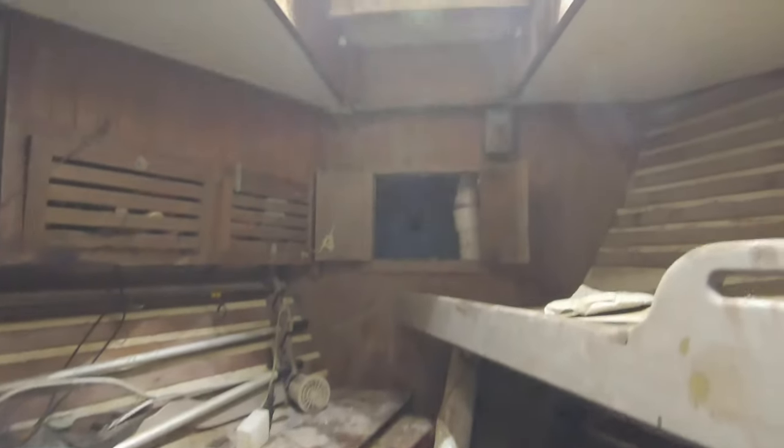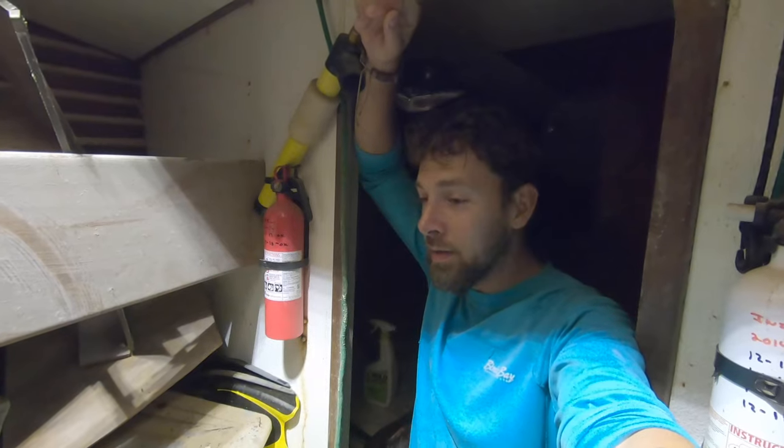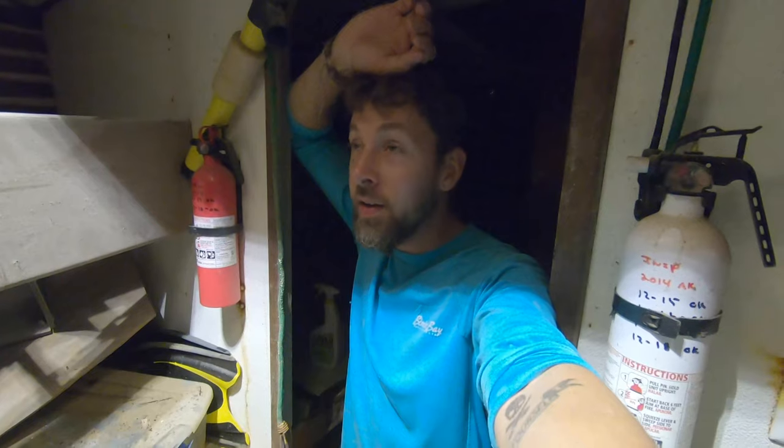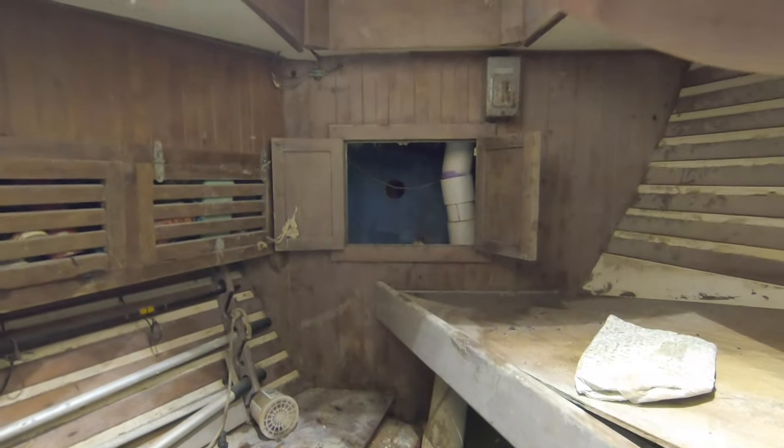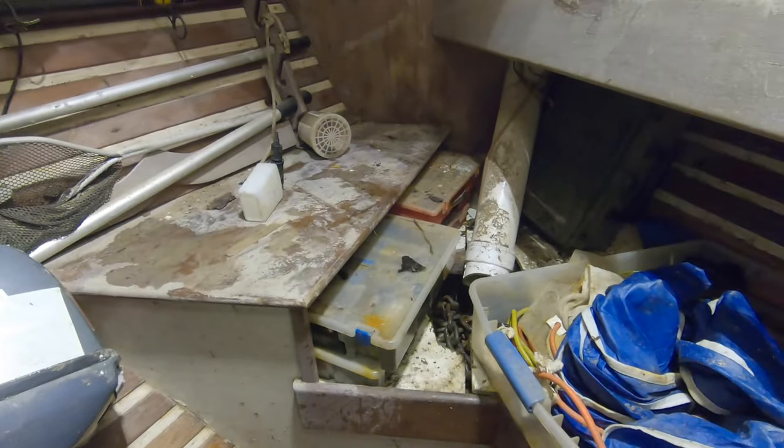I found the front of the boat finally. It's been a long day of digging stuff out of here. There was so much stuff on the deck I was afraid I'd do damage, so I had to move it all to the dock. This is a big room — lots going on in here. Looks like it was being used as a workshop. He's got a dive rig over here, tools and gear, and the engine for the dinghy. That room up there is the anchor locker — where all your chain goes when you pull in your anchor. He's rerouted it down to this box, but that PVC pipe runs up to the deck and that's where the chain is falling through. That means this room is always going to be musty — I want to remove that pipe, put it back the way it was, and have this as a bunk again. With these two bunks here, that gives me a total of ten bunks, so I can bring the whole family with me.